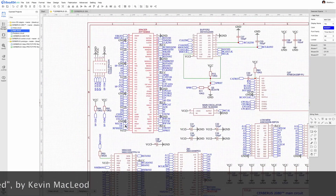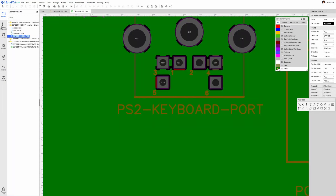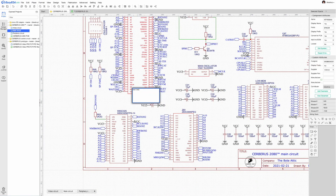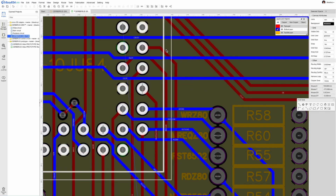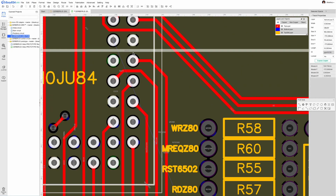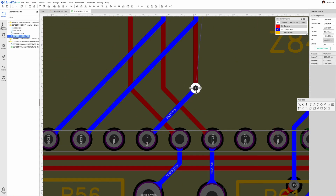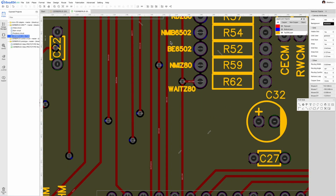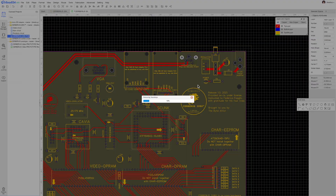And so, we've come to the end of the series. Since last time, I've updated the PCB with the final improvements: connecting the can of PS2 connector to ground, changing a trace that I needed to change, optimizing other traces, making some improvements to the silkscreen markings of the board. Since I was making another board as well, I basically only had to change one trace, but I decided to make general improvements everywhere to have a good feeling that the project was well concluded. So that's what you see me doing now — all these little details to the board.